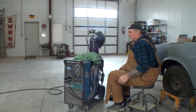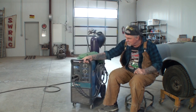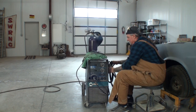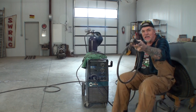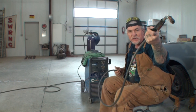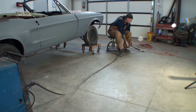The first thing you're going to want to do before replacing any liners or taking anything apart is you're going to want to reach around and unplug your welder, make sure the power's off completely. Then we're going to unravel our welder cable and housing. Once we get that all unraveled, we're going to lay this out on the floor and stretch it out so it's completely flat with no twists in it.